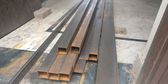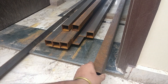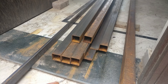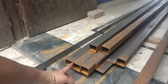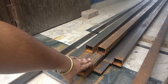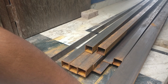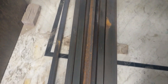This is the material I am going to use to build the main frame of my CNC. This is 4x2 box pipe which is going to serve as the gantry rail. These are 2x2 angle iron which are going to support the main bed, and some L brackets will be made with this material. These are 2x2 square sections for the legs and middle braces, and there is also 2-inch by quarter-inch thick mild steel bar for closing the open ends of the box pipe and making flanges for fastening. The overall length of this material is around 6 meters.